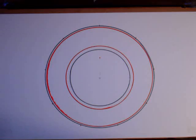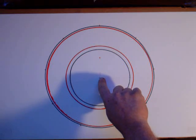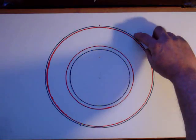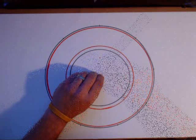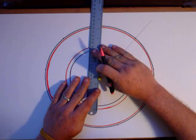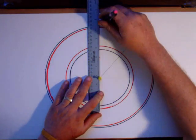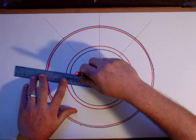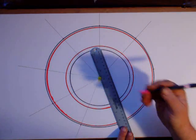From here out, I'll come from the center line, put the pin back in, lay my ruler against it, and draw straight out. The size of the pin is about the width of the pencil mark, so I take the ruler right over to the edge. I'm drawing from here straight out far enough — the lines have to go outside the dimensions of the rotor because the coils do, and that's what we're planning with these lines.